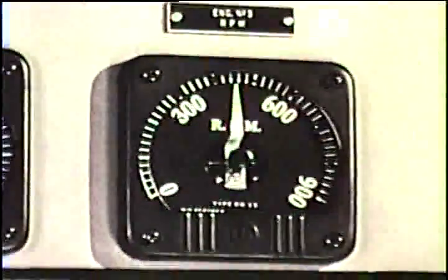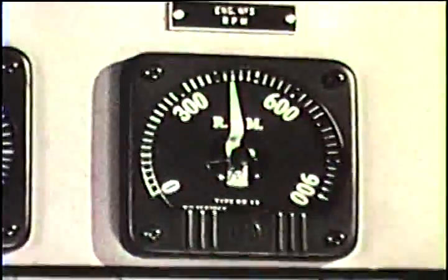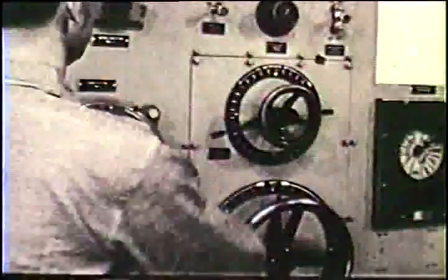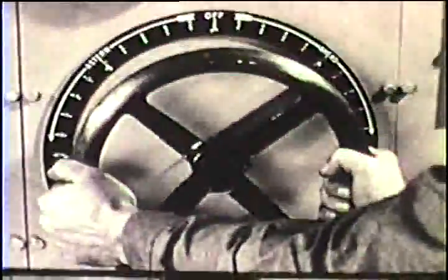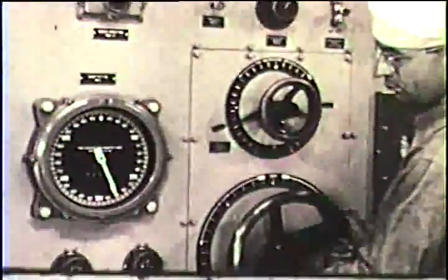When the engine room gets an engine started, its generator can be cut back into the propulsion loop. Check the motor field controller to see that it is at the mark for one generator operation. Turn the individual governor control cutout switch to on, and the generator transfer switch to propulsion. Push in the main field cutout switch and turn the speed controller to bring the propeller speed up to the required RPM. A generator is now back in again, delivering power to turn the port propeller shaft.